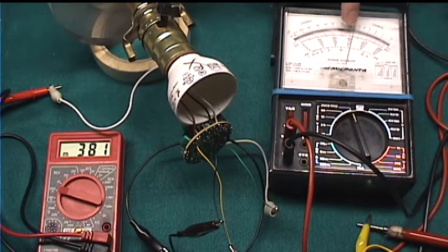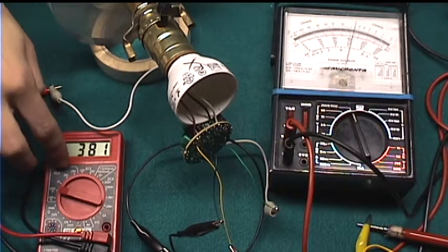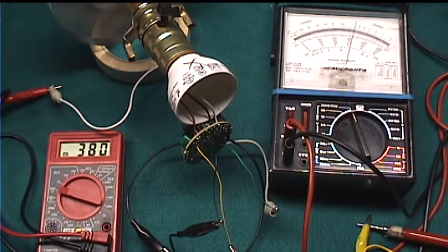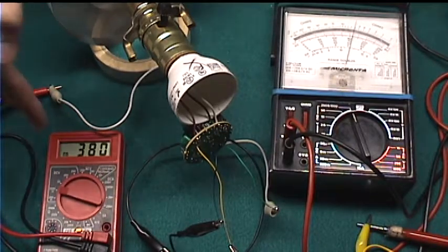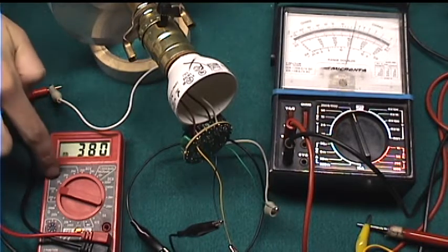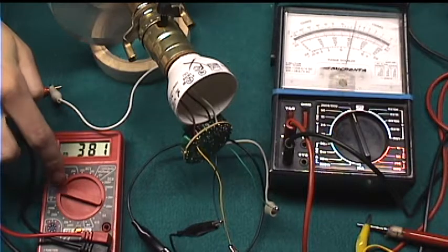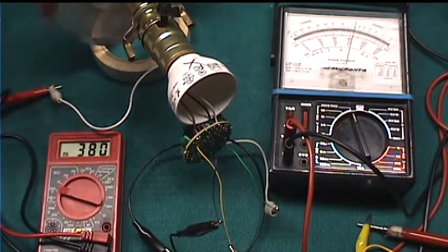Okay, this jumped up. To get the actual number, it looks like a bit over 300. And this is showing like 0.35 volts-ish. Again, more than I was expecting, but still not enough to turn on the transistor. I should keep in mind I still haven't changed the battery in this, so its reading is a bit higher than it actually is.